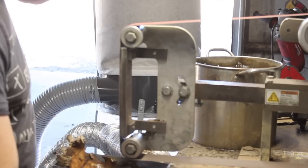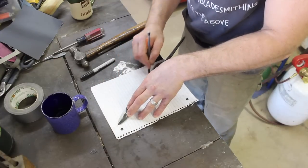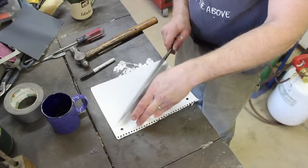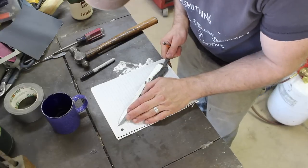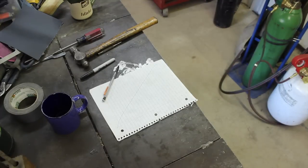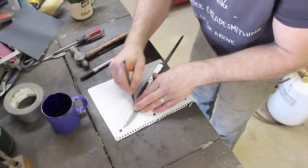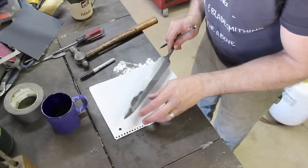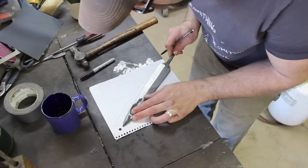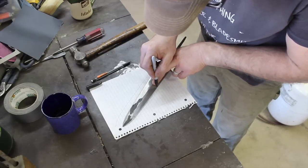Making sure you're grinding back to steel that has not been decarburized. 80 CRV2 is pretty bad for decarb, a lot worse than most other steels — I'm not sure why, though there's probably a metallurgical reason with the alloy components. Now that the profile is roughly established, I take it to a piece of paper using a technique I like: you draw around one side of the blade, flip it over and match it, see where it falls over or under the line, and grind down the side that falls over. It took about four or five times to get it dialed in pretty close.